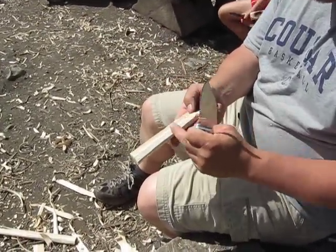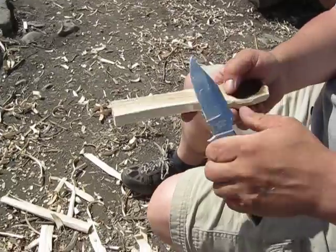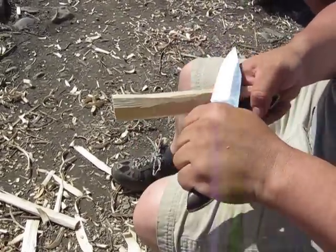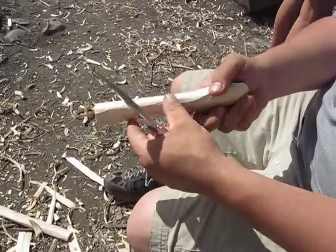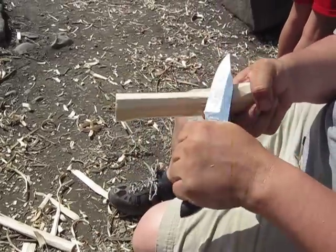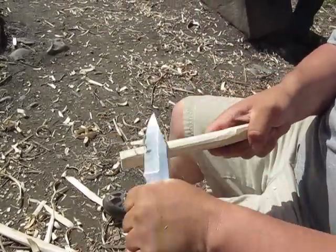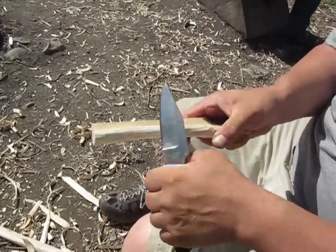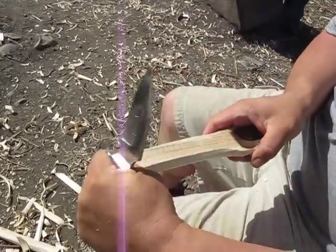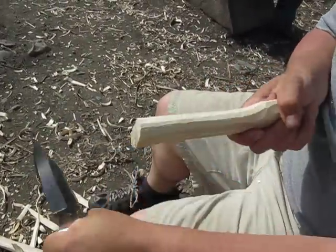What I was saying before is that if you follow ridges when you carve, if your knife has got bumps all over the place, it's really hard to get a long string, especially for your handle. So you want to try and follow a nice long ridge. That way you're only taking a thin strip of wood off every time you go down. And if you keep your knife at a nice angle, you won't carve into a point — you'll actually carve a straight line.